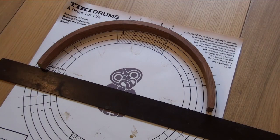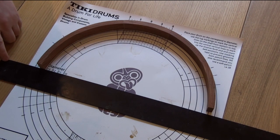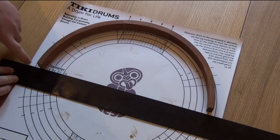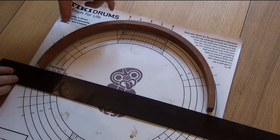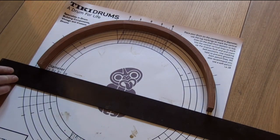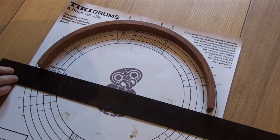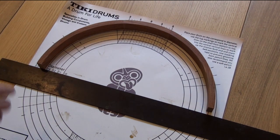I've now sanded five pieces. Using a long ruler as a straight edge, I've set the first segment touching the ruler on the 14-inch circle and continued placing segments with joints tightly together. There's a gap here at the end — which means the angle isn't sharp enough. It was too sharp before sanding, and now we've gone slightly the other way. So we need to make a very slight adjustment to the disc sander setting to make the angle slightly sharper again.